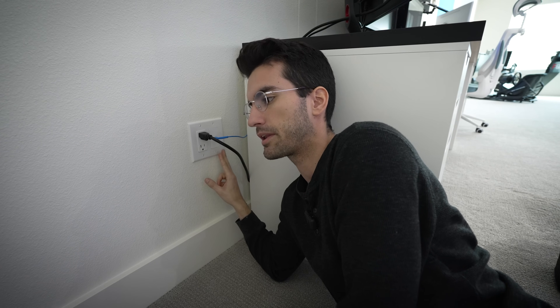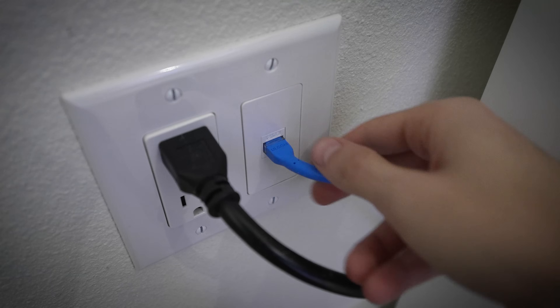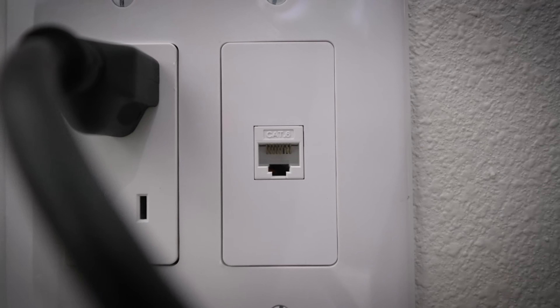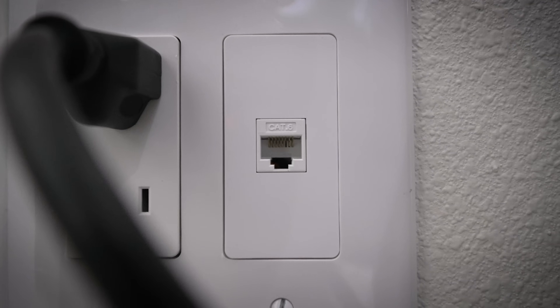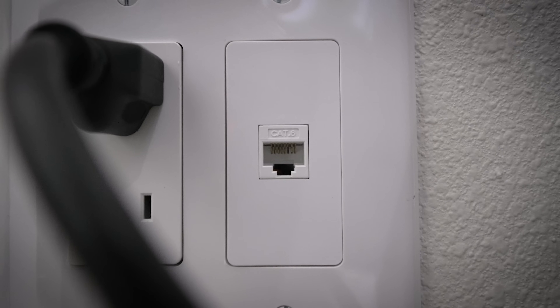This is the plate where the ethernet cable attaches to Lisa's PC. From here it runs to the switch — that's how we get internet. We know it's probably not the cable; we've already ruled that out. But this keystone, which attaches to this wall plate, does not look good. And this is what I was beginning to suspect — we're not getting a proper connection here.